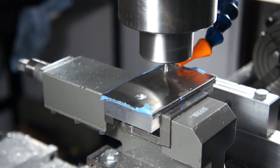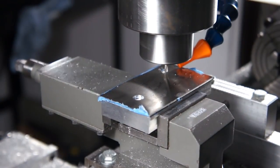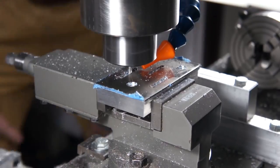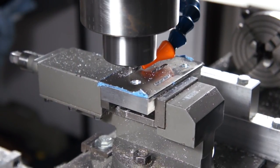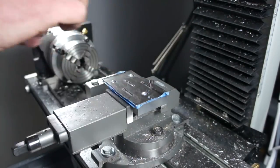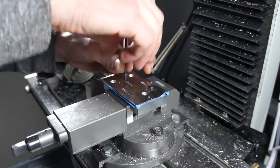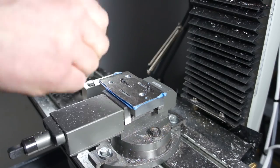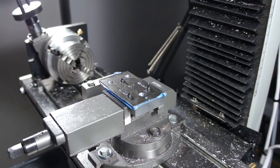I have the air blast on to keep chips out of the cut, and I'm experimenting with shooting oil to see how a mist system might work. Later in the video I take the air blast out of the way and go with just an oil system. Those cuts were taking incredibly long so I'll jump through it. Here you can see a bit of the slotting operation. Then I install the little fixture screws to hold the part down — it made it through that entire cycle of drilling all the holes and making all the slots without any movement, which I fully expected given the surface area. But going forward once we start cutting the profile I don't want things to move.